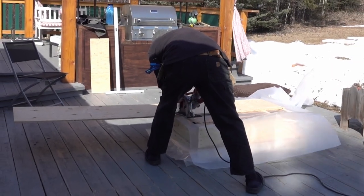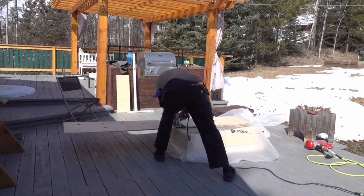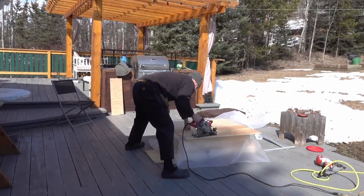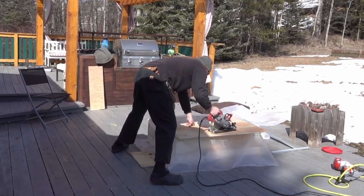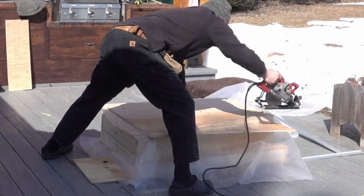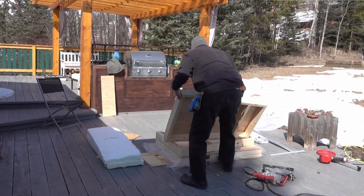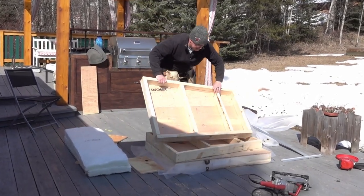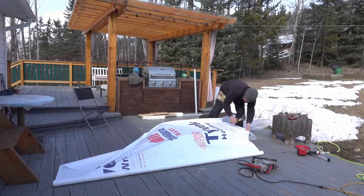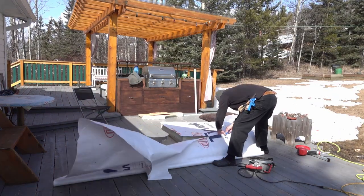The interior wall was vapor barriered and sheeted with half inch plywood. Yeah, the wind sure helped with this process. Walls were then flipped to install R12 fiberglass insulation and Tyvek applied to the exterior. This will allow the wall to breathe somewhat and allow moisture to escape. More fun in the wind.